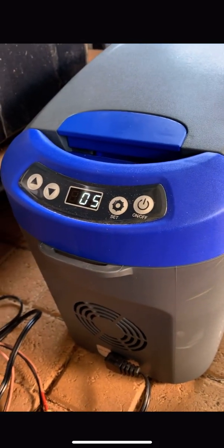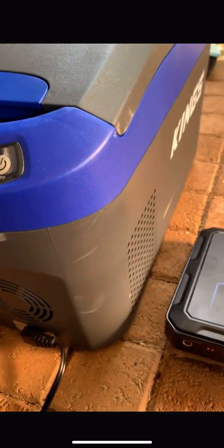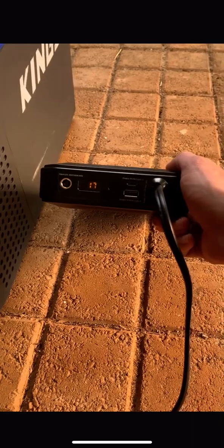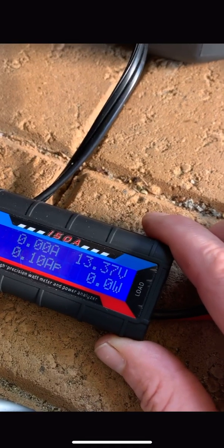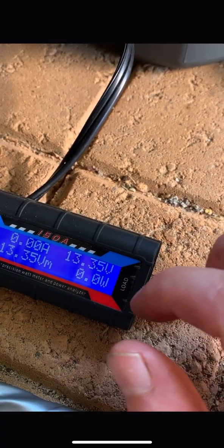The fridge has been running for 17 hours now, which is pretty impressive, and we're at 17% with the voltage still holding above 13 volts. That confirms to me this is a regulated port, which is great. Currently showing 6.38 amp hours and 82 watt-hours.